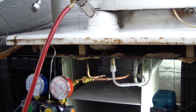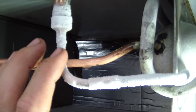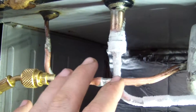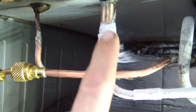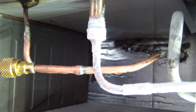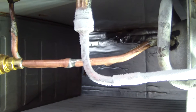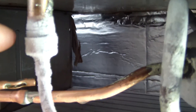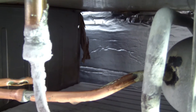What I ended up doing, reluctantly, was pull this 3/16th line — I wasn't planning on doing that until I had to pull all this apart to refinish and repair all the wiring. What I did was I pulled that and tried to take a small torch tip cleaner up through there to see if I could fish around and poke through. I think it was too big. I read on the Monitor Top forum about using a size smaller than any wire tip cleaner I had. I went and found a stainless steel wire brush, pulled one of the bristles out, and poked around in there — still couldn't get anywhere. So very reluctantly I cut the steel tubing. There's a groove right there. Cut that tube and it worked out to be in the right spot — about a half inch from the end.